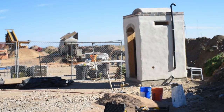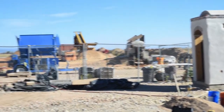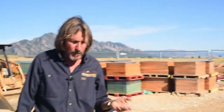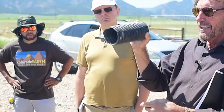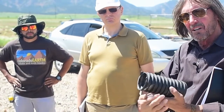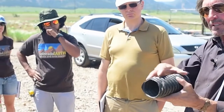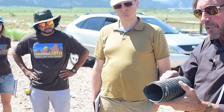That particular building has a 12-inch tall stem wall on it. The code minimum is six inches; we typically do eight. Typically, you put a French drain in the bottom of the gravel trench — it's a four-inch perforated pipe that runs along the bottom of the trench so that any moisture transfers down through the gravel into the French drain and is taken away.